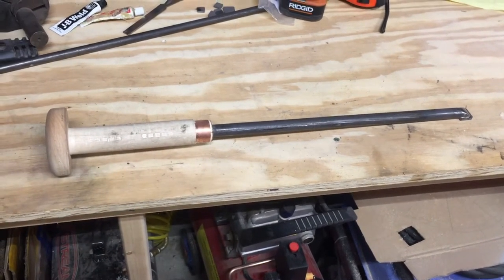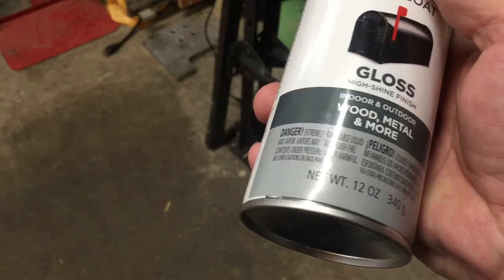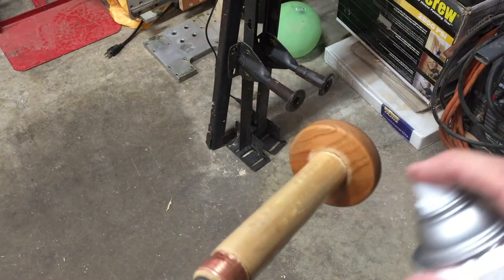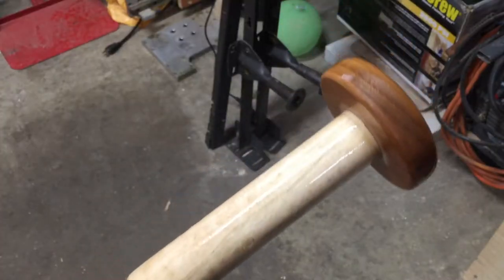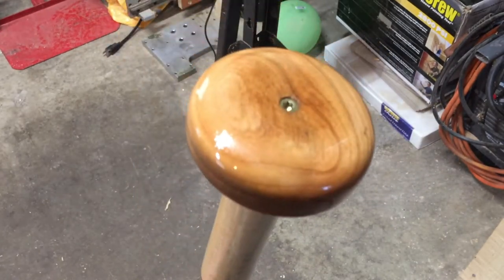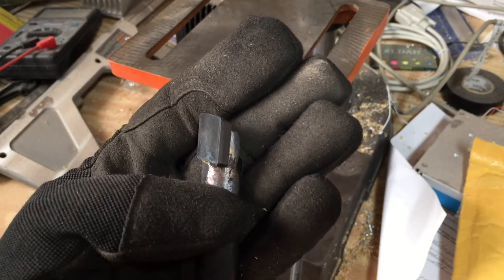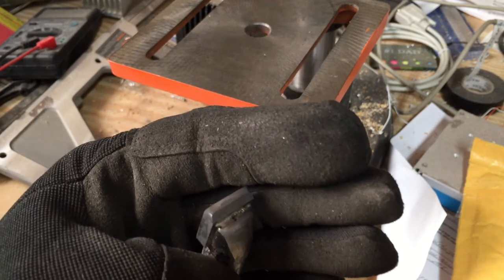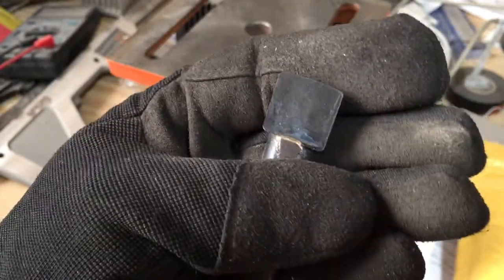After some finishing touches like sanding the handle and applying clear coat — about three coats of clear coating — I was able to bring all that cherry beauty out. Look at that beautiful cap. I sharpened it with a rather large radius, so this must be a finishing scraper — it will not put deep gouges in the material but will rather leave shallow, flattening scraping marks.